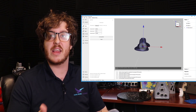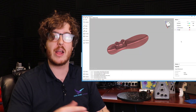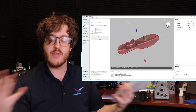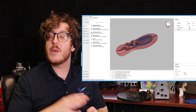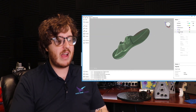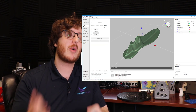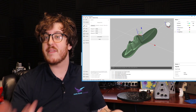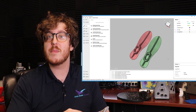Some other cool things we can do beyond just cleaning it up is mirroring and scaling the parts. Now that we have our initial model cleaned up and orientated to a coordinate system, we can duplicate it so we have our old version saved. With the duplicated one, we can scale it up by 15 to 20% if needed, or even two times — all done through a centroid, so it's very uniform scaling, not in just an X or Y direction. Not only can we scale it, but we can even mirror it. So instead of having just one version of this shoe insert, we can mirror it across that coordinate system to get a different version. This is all done directly with the mesh — no modification needed — and it's a uniform mirroring based off of that coordinate system. Because we've aligned it, there's a very clean mirror.